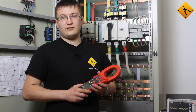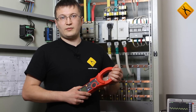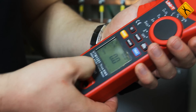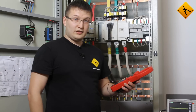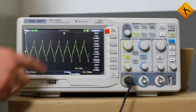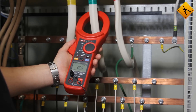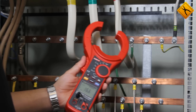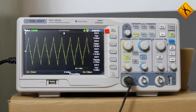Now we want to demonstrate the possibilities of the analog output, which may help to better analyze the line current waveform. Since most of the load is provided by electronics with switch mode power supply units, the current will be far from a sine wave. We open the output connector, connect the probe to the oscilloscope and to the meter, then start measuring. The first conductor reads 55 Ampere, with a voltage value of 54-55 mV — the waveform is different from a sine. The second conductor reads 40 Ampere and the voltage value corresponds. The third conductor reads 75-80 Ampere, and the form is also far from a sine wave.